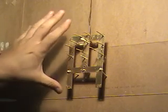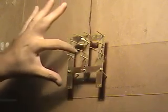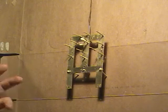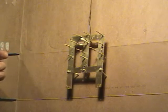What you're looking at is the back plate of the movement. We've polished it up, and we'd like it to keep that appearance, so we've pegged all the different bushings and holes on here. We're going to put a clear lacquer on it using a spray — very thin coats, very little at a time — and this is slowly going to build up to a nice thin plastic coat over it, keeping it from tarnishing. All brass darkens with age, but with this it's going to last a lot longer, and you'll be able to enjoy the beauty of the clock. This is another step we do in what I call the presidential repair.